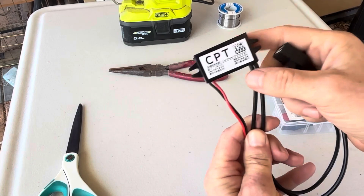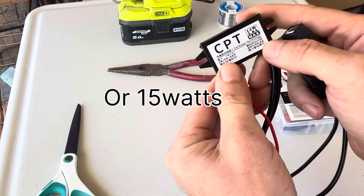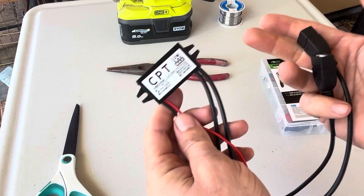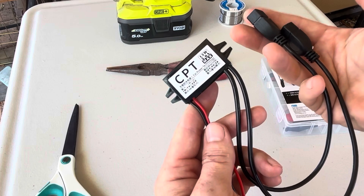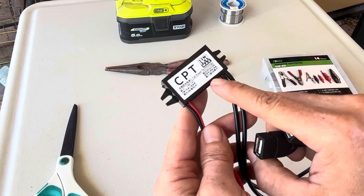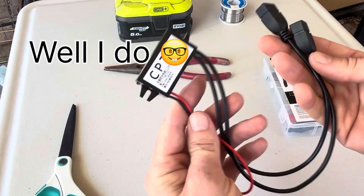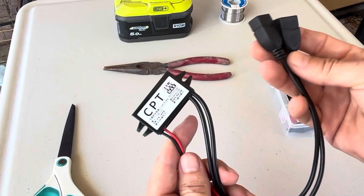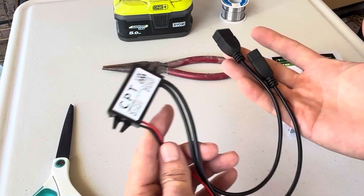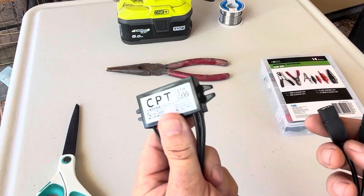You'll also need a little 12 volt to 5 volt DC converter. This converter has USB-A ports already attached, which is handy. It's a 3 amp max output with 7 volt to 22 volt input, so it will suit most 12 volt panels — very versatile. If you need emergency power, it's pretty easy to get yourself a 12 volt panel. Hook this up and you can keep your phones, torches, and other devices charged providing the sun is shining.